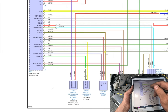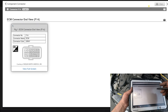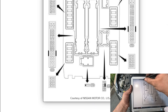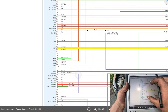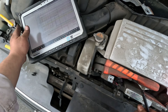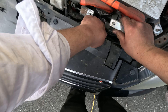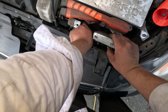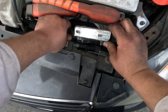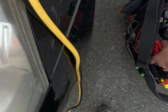Pin 14 is gray - yes, that's the first connector. And the white and black wire is on pin 24, so let's go look at that. The short goes away when we unplug it, so now I can plug the other connector back in because I'm almost sure the short is coming from the relay.